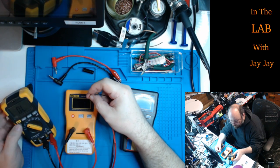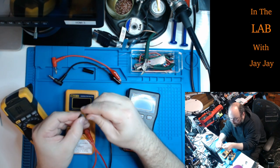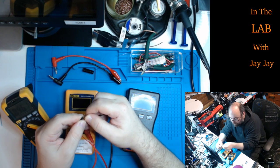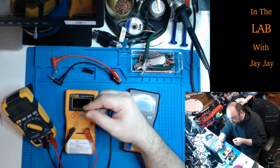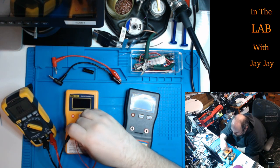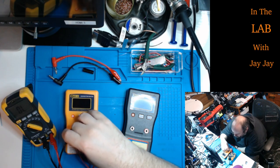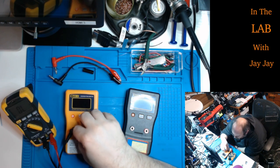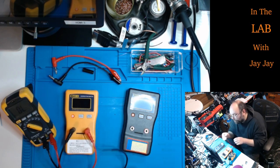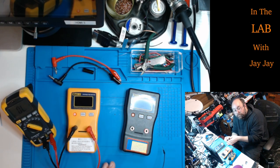So what about if we hit mode, voltage, capacitance, resistance, voltage, oh, there we go. Yep. Okay, that's what we want. It's only a faint beep, but it'll do. So we should find beep, beep, beep, no beep, no beep, no beep, no beep. And then we should find beep, beep, beep. Yep, that was exactly what I expected to see. So the four pins on the left are negative and the four pins on the right are positive.